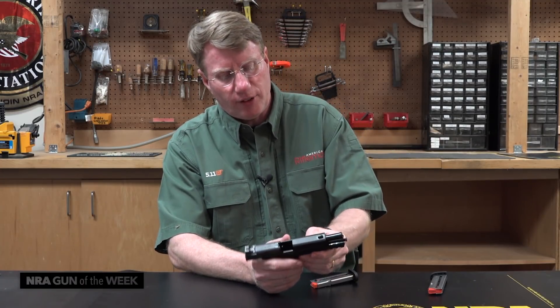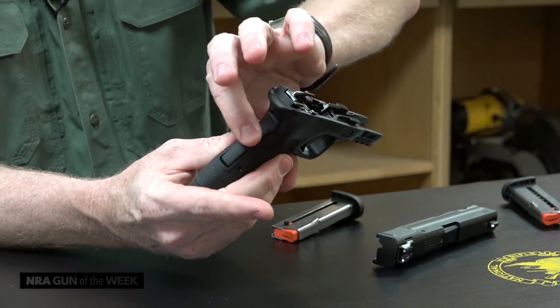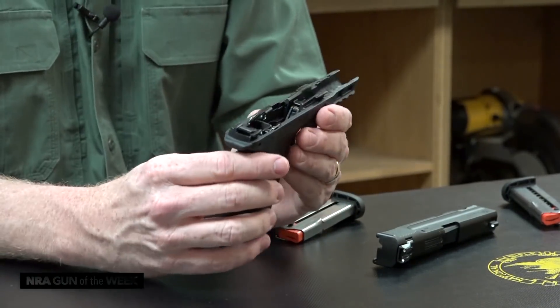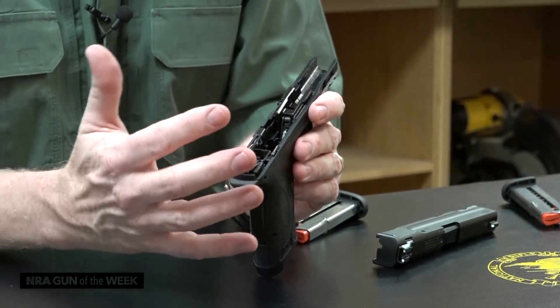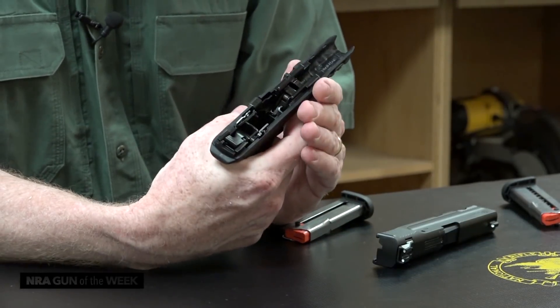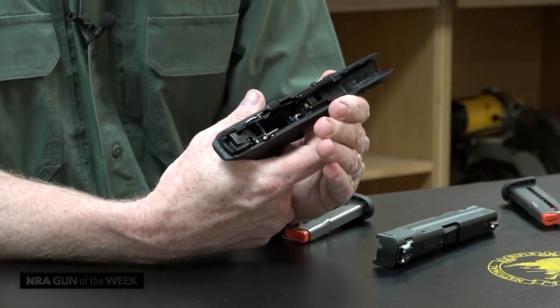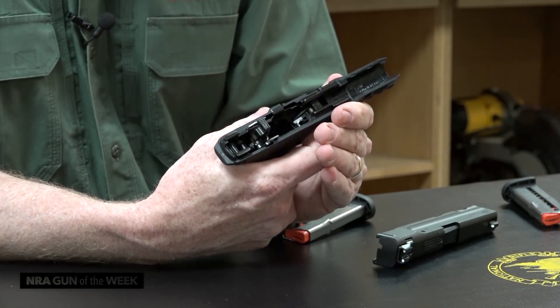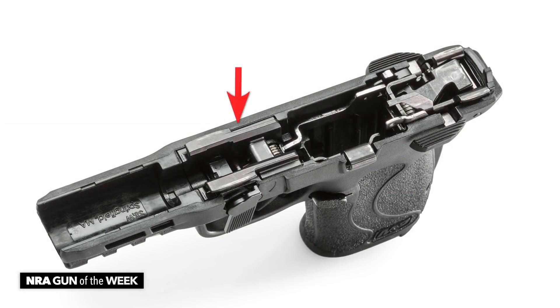When you take the slide off you can see what's going on on the inside. This gun does have a grip safety right here, and the reason the grip safety is there is because it links the disconnector — or they call it the connector or disconnector. The trigger bar is pulled rearward, but you can't actually activate the sear unless that grip safety is depressed. This is not a chassis gun — you have your locking block up here at the front and your fire control unit at the back.